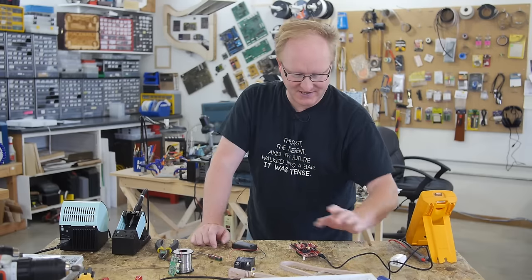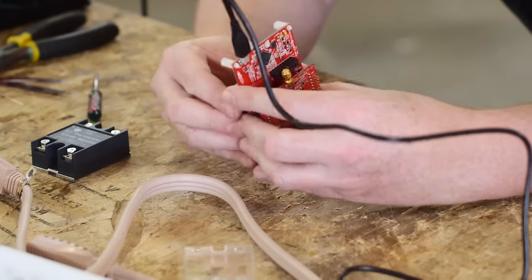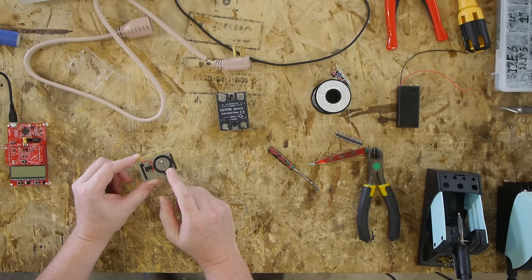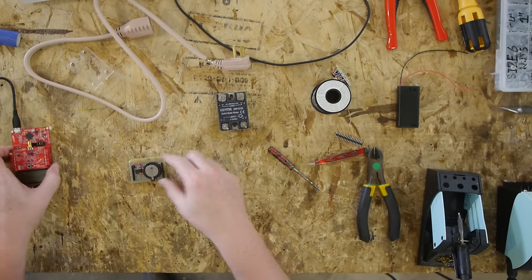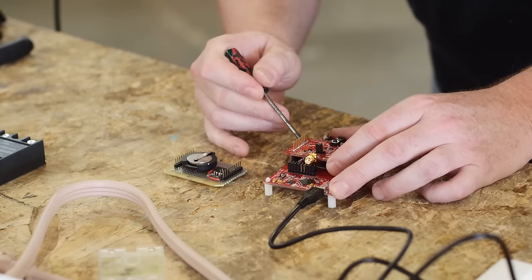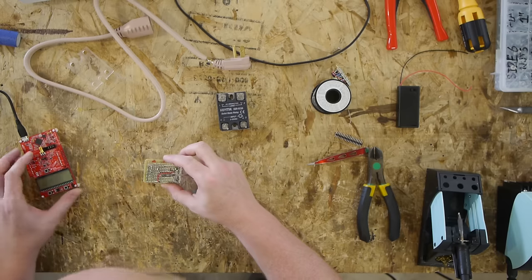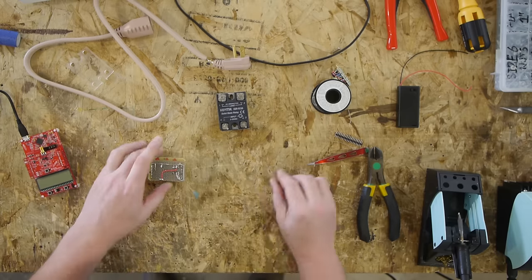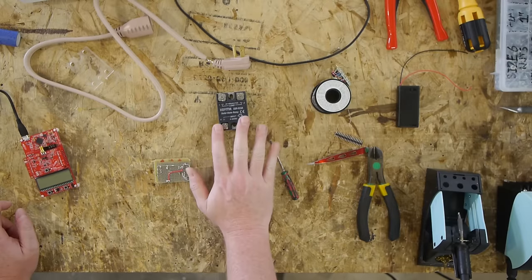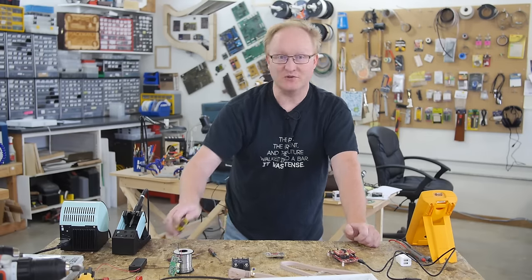Let's rig up a test. We've got our board here. Get rid of this battery pack, we don't really need it. Now I should be able to remove this real-time clock pack, and it's still got its own battery, so it will keep the time. In the earlier example, we were looking at the pulse on this pin, and I've since programmed it to actually activate when the light is high or low. So that would be 1, 2, 3, that pin right there. What we can do is attach two wires to this board and connect them to the relay, and that should give us relay control from the MSP430. So let me grab some wires and we'll do it.